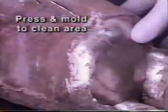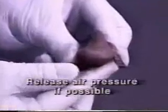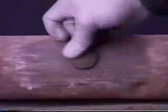Note that the surface must be cleaned and abraded beyond the putty patch area. Plugging a pressurized hole or leak requires precise timing and practice, and works best on small, clean punctures or cracks. Air pressure should be released if at all possible. To plug a leaking hole, press the putty firmly into the leak and hold securely in place for three to four minutes as the putty cures. If pressure on the putty is released too quickly, the partially reacted putty will not develop full adhesion and the pressurized air will blow under the plug. If attempts to reattach the putty fail, it must be discarded and the process repeated.